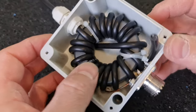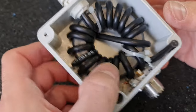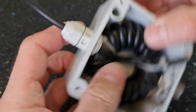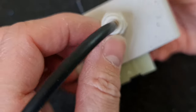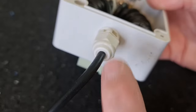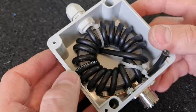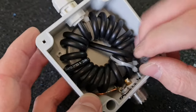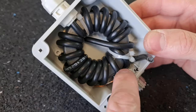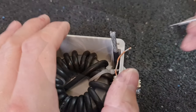So very hardly I fitted this whole core into this box, but you can see that it is in. That's good. And I tied it at this opening right there. You can see that the rubber is pushing on the cable, which makes all this system waterproof. So the last thing is to connect the end of the coaxial cable to the center pin and to this shielded pin.